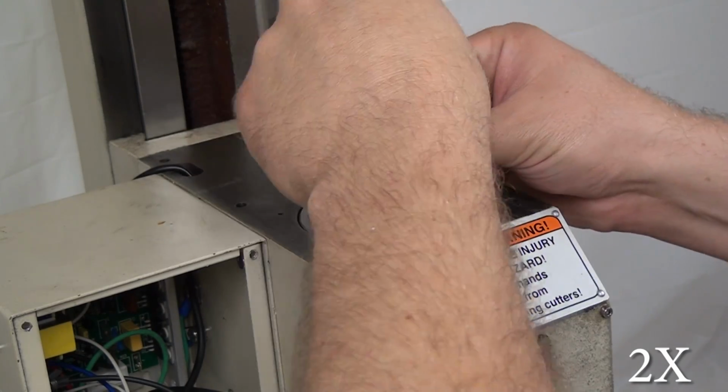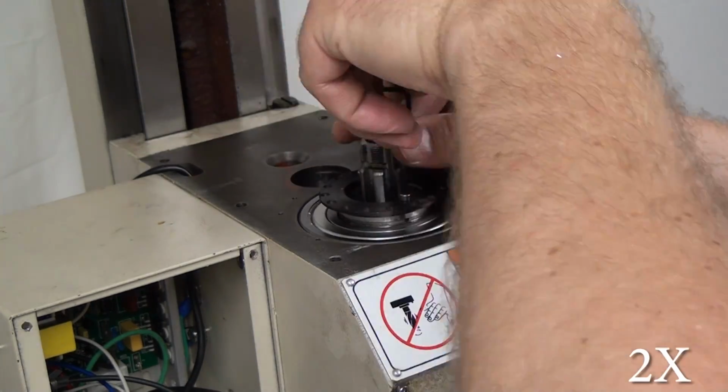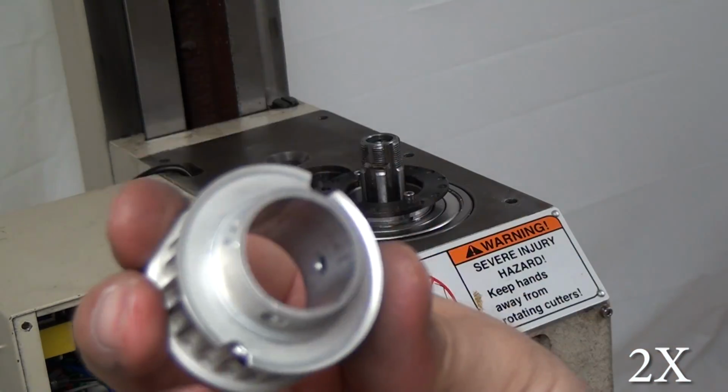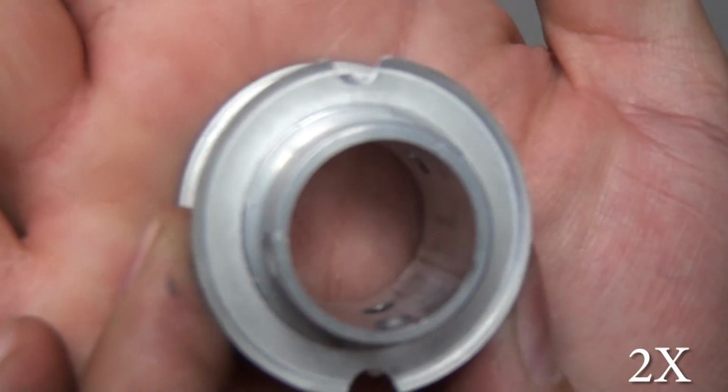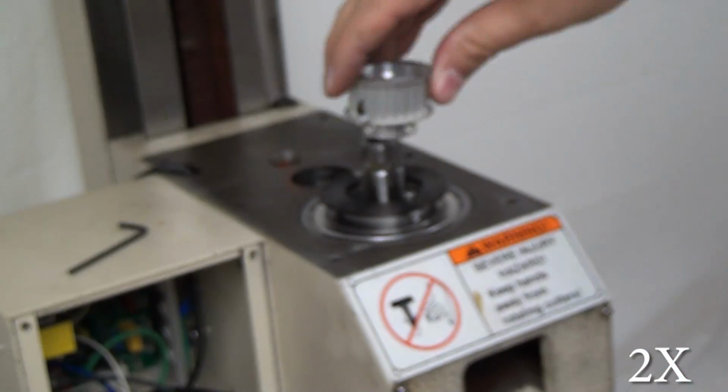Now, in this shot you don't see the C-clip, but the C-clip needs to go on before you put on the tachometer ring, and 2 little screws hold that down, and you'll need to relieve the pulley so you can get around those 2 little screws. Now, these are the little screws I'm talking about.